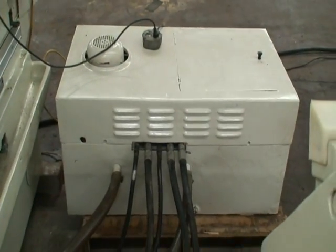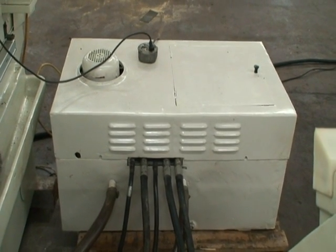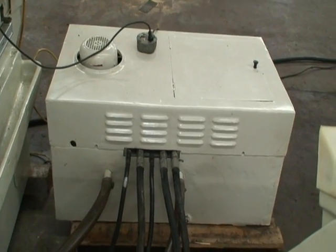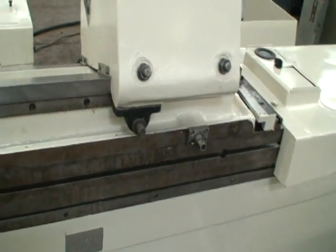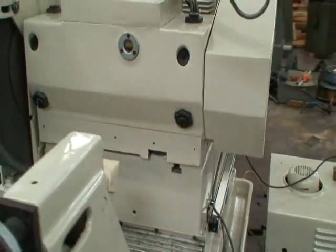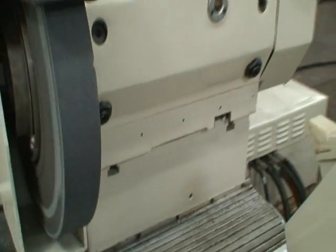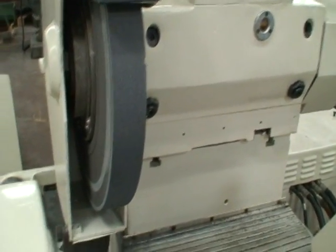This hydraulic system — we drained the fluids completely, flushed, cleaned, blew out. Made sure that everything was in very good clean condition. We had the table off. We repacked the cylinders with new seals. The entire table system came off. We had the wheel head off as well and did the hydraulic cylinder feed system for that. Cleaned everything. We did paint the machine.